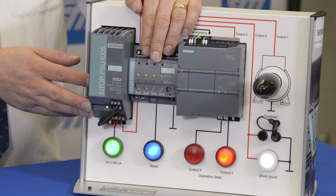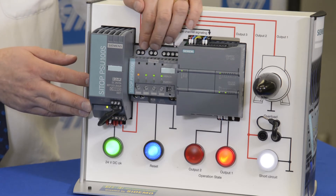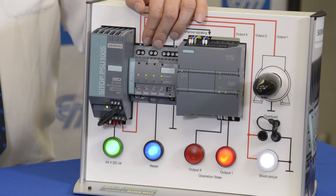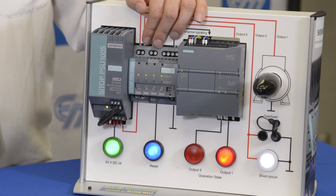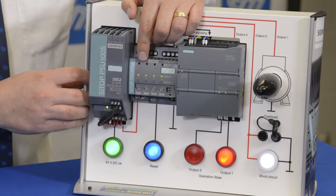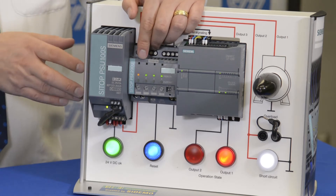This module is available with a pulse output so that remotely I can identify which of these outputs is experiencing an overload or a short circuit. For that matter, I have disconnected load number one and I can tell remotely that load number one is off.